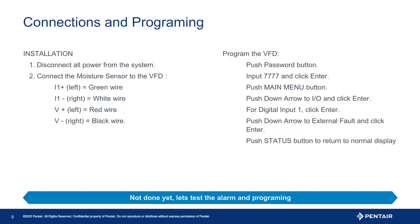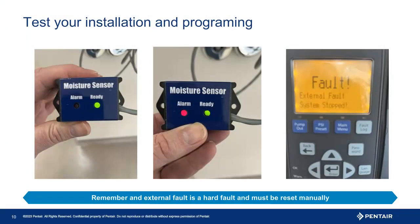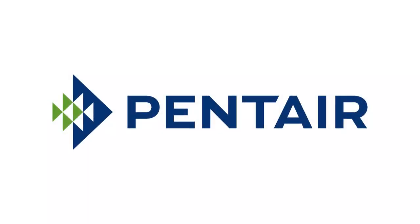Now you are ready to test the sensor. Before mounting the sensor, let's test the setup. Start the drive, ensuring it is safe to run water, by pressing the auto button. Wetting your finger, cover the two probes to complete the circuit. This should trigger the sensor to the alarm red state — the drive, programmed correctly, should fault and stop immediately. As the unit is functioning as desired, mount the sensor in the desired location. Congratulations, you have successfully connected and programmed a water sensor safety. For more information please refer to the owner's manual. Thank you and see you next tech tip.